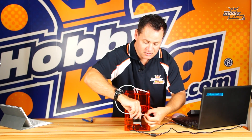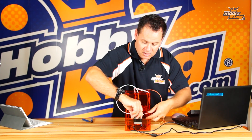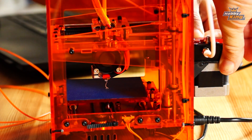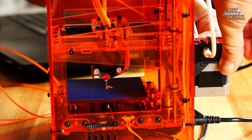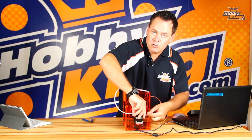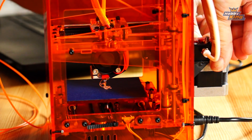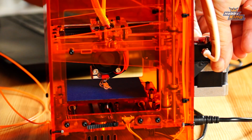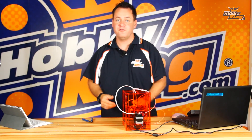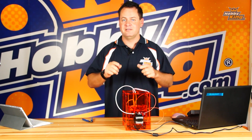Take our prepared filament — our new color — pull the clamp, and insert it just like loading new filament. Push it all the way through until it starts to come out the bottom. Once plastic is flowing out, continue until you see the new color come through, meaning we've primed the head with the new color. There we go — now we have orange coming out. Key point: make sure you push in before you pull out.